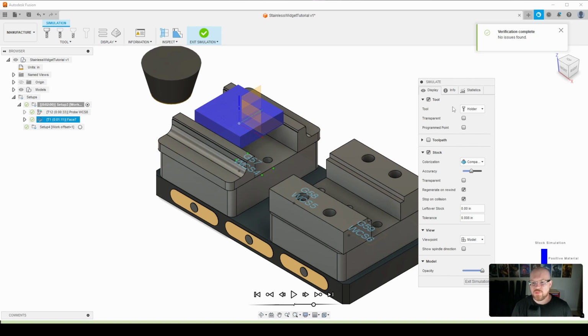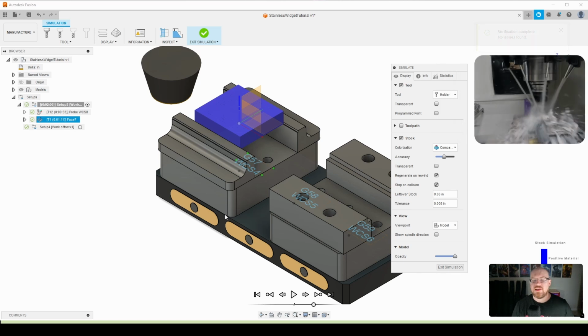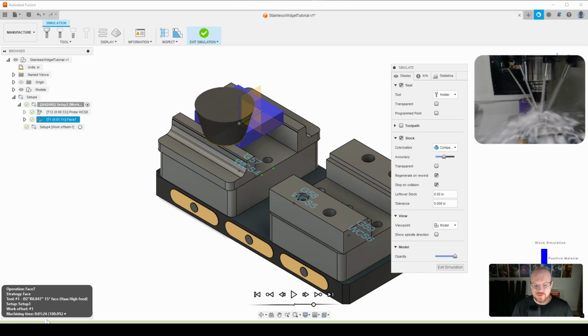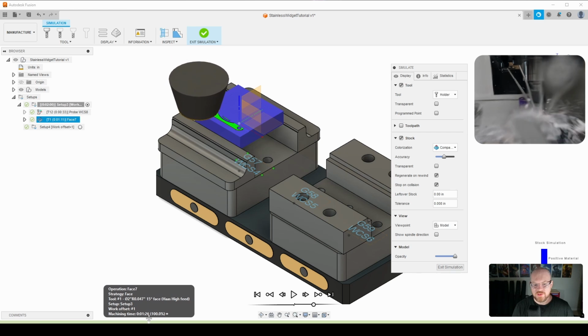So the reason I'm going conventional and not both ways is because I have the umbrella tool changer with my style, and that means my coolant flow is coming from the right side of the spindle and sort of hitting the front face of the shell mill. And so let's go ahead and just drag the timeline here. You'll notice I go from left to right, I pick up, and I go from left to right again.